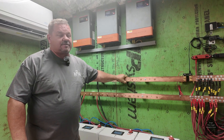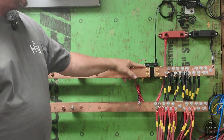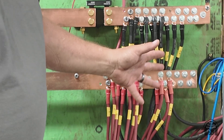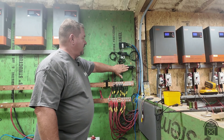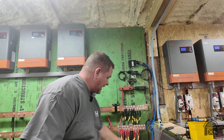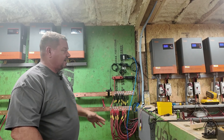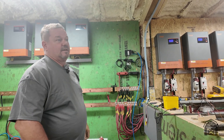There is a tremendous amount of current going through it — this is a 200-amp shunt so I can monitor how much current is flowing. This is where all the inverters tie in, each one labeled so it's easy to sort out later. There's also a small tie-in for my Solar Assistant controller and monitor system, so I can watch on my phone. It ties into the battery pack so I can see current in and out, state of charge, and everything on the inverters.